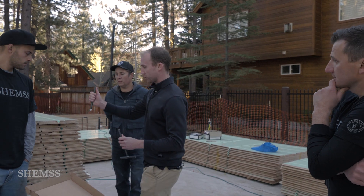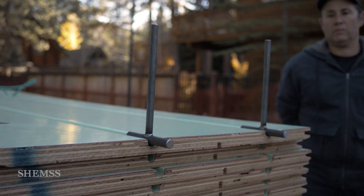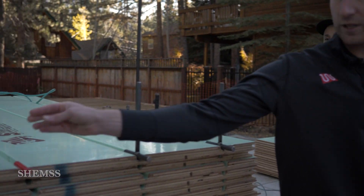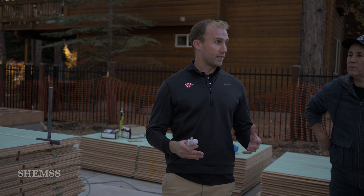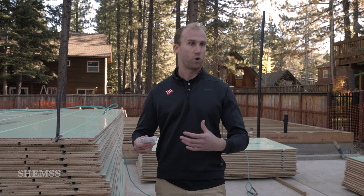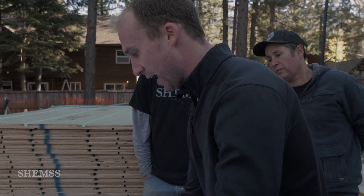Within the installation kit you'll also find two metal bars called alignment pins. As you're installing your panels, you want to make sure your grooves are lining up for the tubing — place these between your sheets to confirm alignment across each loop. If you lose them, a piece of PEX tubing does the same thing. We're also able to actually route the panel itself to get tubing where it needs to be, and these router bits help guide tubing back to the manifolds or different zones.